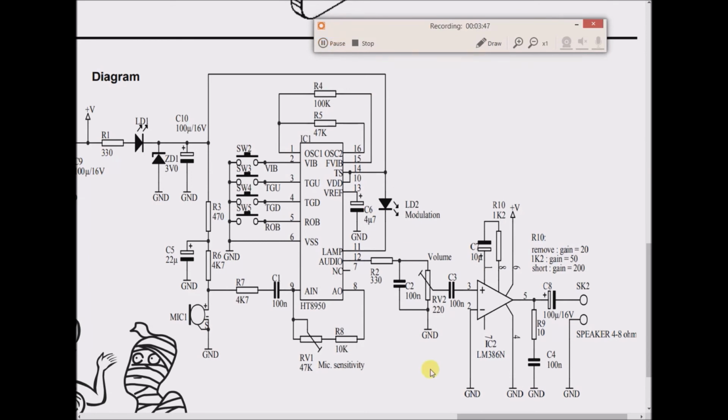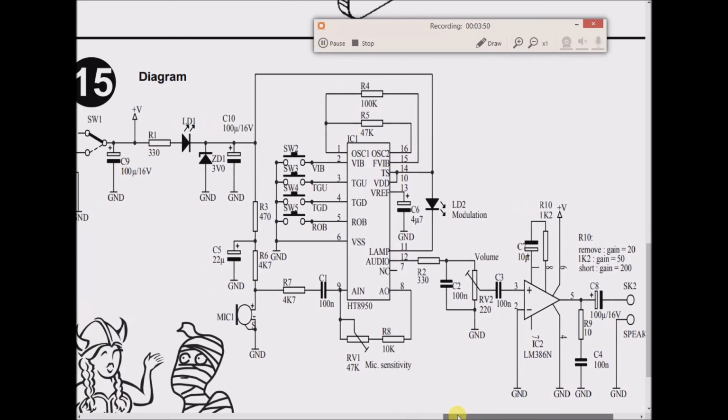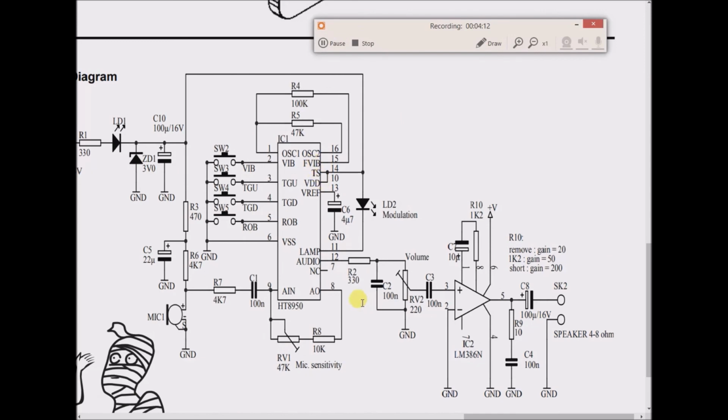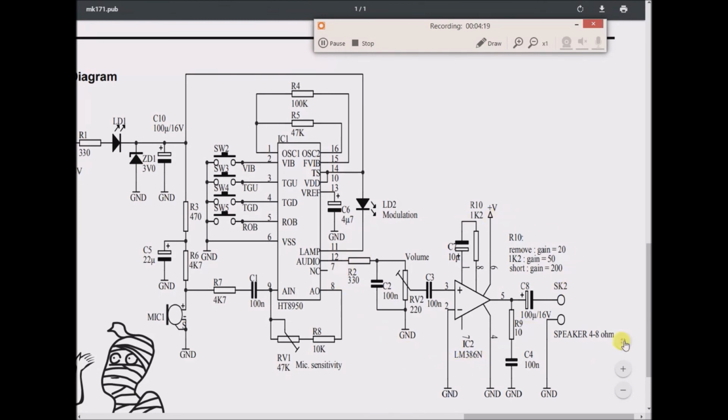But what I'd like to do, in simple terms, is maybe something like this. Build a 3-volt regulator, and heck, maybe build a couple at the same time so that I have them on hand. Then build the circuit more or less how this is built here, although this is the 16-pin chip, whatever. And then build just this portion of the circuit and kind of leave this one hanging for experimentation, and maybe I can build a separate amplifier or tap this off for use with the telephone or CB radio, probably CB radio. So yeah, that seems like a plan on how I want to design this.